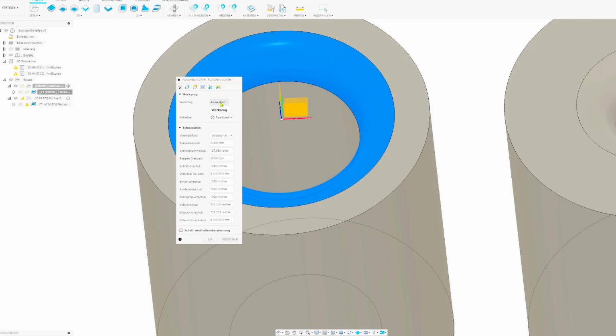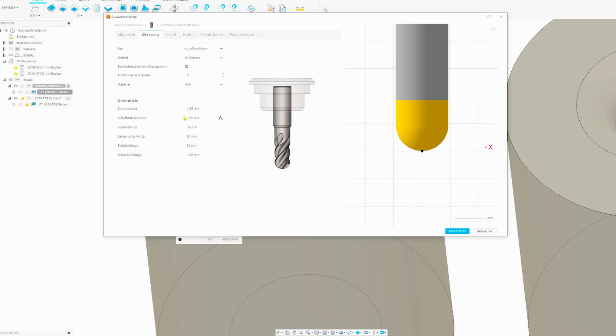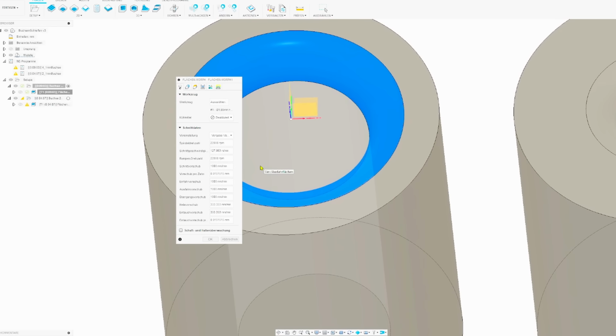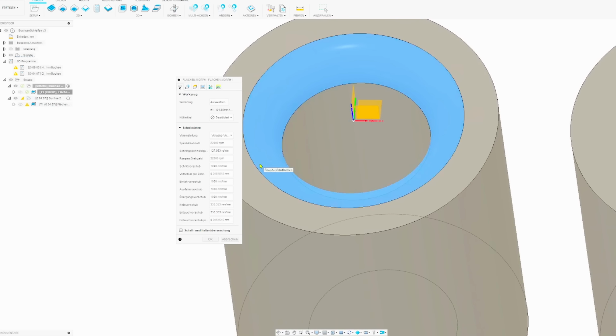Let's edit. So I defined the grinding tool as a 1.85 millimeter ball end mill, basically. That's the size that I checked with a micrometer. Running it at full speed, 22,000 RPM. Yes, the spindle can go to 25, but I think it's good practice to not max out the spindle. The overall lifetime of the spindle will thank you. That comes from experience. We found at my former day job that high-speed spindles that you do not run at full speed live significantly longer.